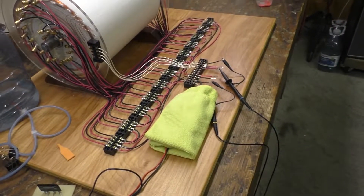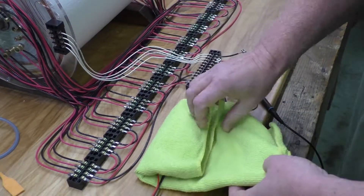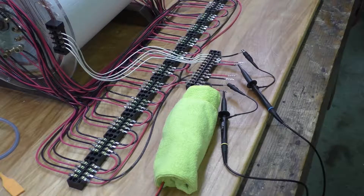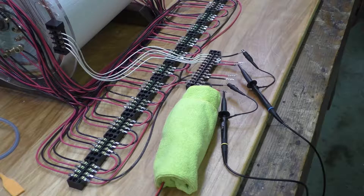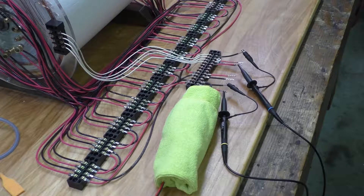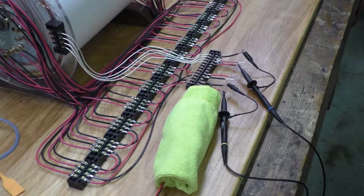When it comes to the open circuit voltage, it's all over the map and seems to change from day to day. I've got a small rag on here just to cover the noise of the relay. Each individual cell disconnected gives anywhere from 200 to 400 millivolts. When I tie all the cells together, I get about 0.3 volts at those two contacts. Milliamps per cell are also all over the map — cell number one gives 24 milliamps, while cell 12 has put out up to 252 milliamps. Some of the lower cells, 2, 3, and 4, have been around 150 to 200 milliamps for a short time, but it seems to disappear.